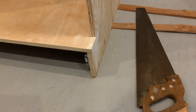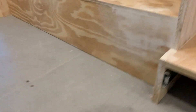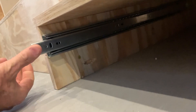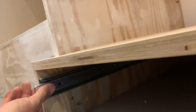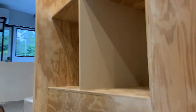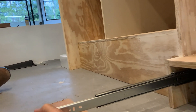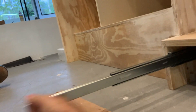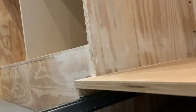Next I'm going to work on getting this drawer installed. These roller slides have a hold feature — it's not really enough for bus travel, this is for regular kitchen use. By the way, these are from Home Depot. They're not the soft pull-in ones; these are the heavy duty ones, supposedly holding 100 pounds a pair. I'm very happy with them — they're very nice and strong, full length 24 inches long.